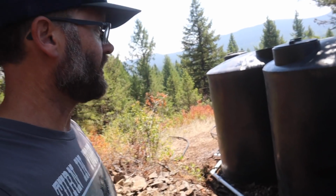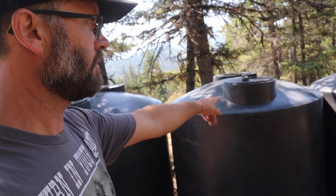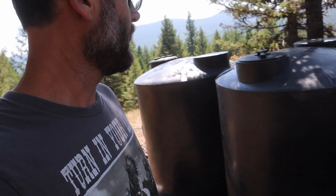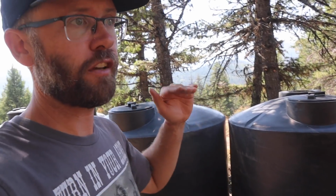and I wanted to talk a little bit about why you might want to consider putting water high above ground in an off-grid situation like I'm in. Okay, so these tanks are 4,500 liters each when they're totally full, and I've got 4 of them, so that gives me 18,000 liters, 85 feet above my main site.